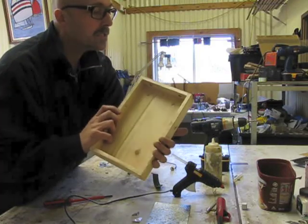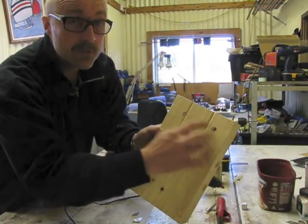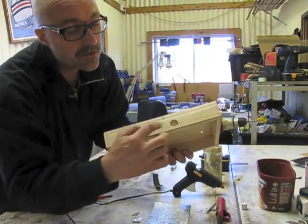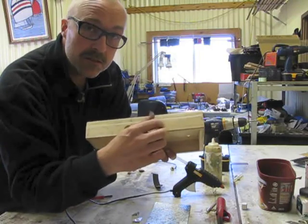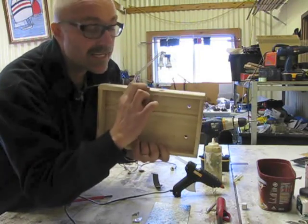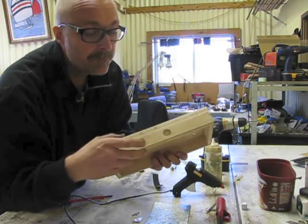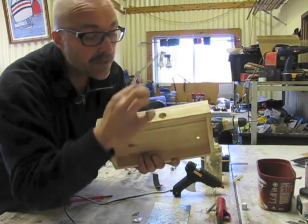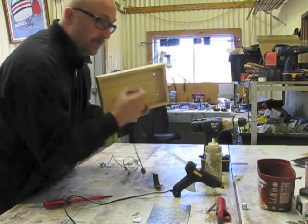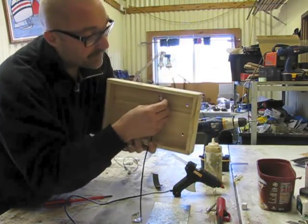You can see here it's just a wooden box. I drilled a couple of holes here and a couple of holes on the side which have been recessed so that the jack plug will fit through and the nut will be able to screw on, because this is a little bit too thick for a standard jack plug. Just drill a large hole halfway through and then a small hole all the way through, and that will allow the jack plug to fit through.